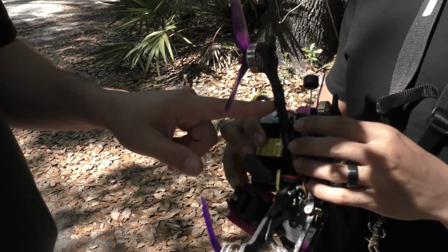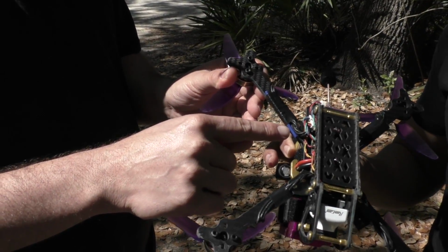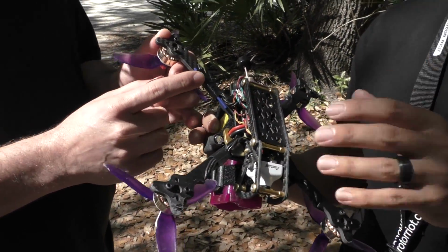This is the worst. I feel bad because you've got the antenna right up against the carbon, which is conductive. It's affecting the antenna's coverage pattern. Fix it? No, this is how some people mount their antennas. No one should use it this way. You really shouldn't.